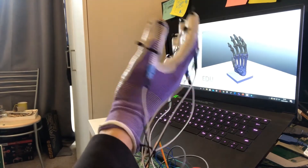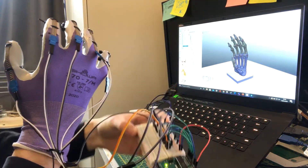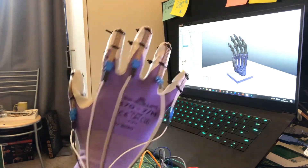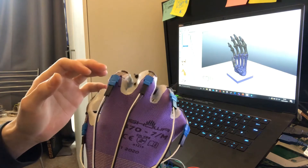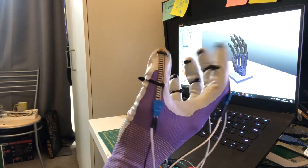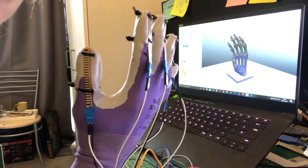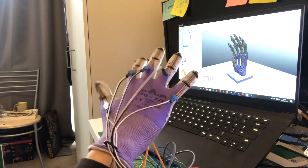This is the data glove I produced for this project. It uses an Arduino Uno and five flex sensors for each finger, coupled to a potential divider circuit with a 10k pull-up resistor. Each flex sensor has a resistance of about 30k ohms when relaxed and 90k ohms when fully flexed. The sensors are held in place at the end by zip ties and fixed at the tip, allowing them to travel along the track without pulling on the other parts. There's also a ring that keeps all the wires down, as when they're up, it can affect the sensor values when fingers are relaxed. It looks like something Iron Man would make.